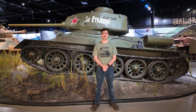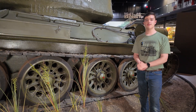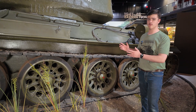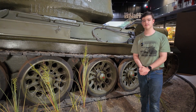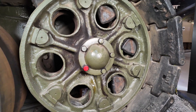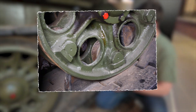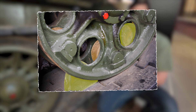In terms of return rollers — we have no return rollers. The T-34 uses a slack track system, so instead of having return rollers, it just lets the track run freely across the top of the road wheels. For the sprocket wheel, the T-34 has its sprocket at the rear, and unlike the last two with exposed teeth on the outer edges, the T-34 uses small rollers hidden inside the wheel to grab onto the center guides and pull the track.